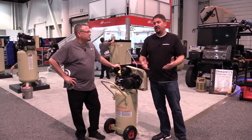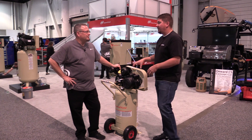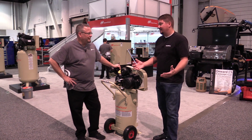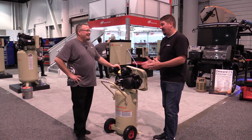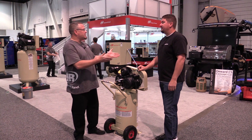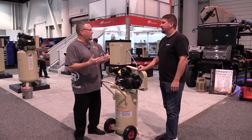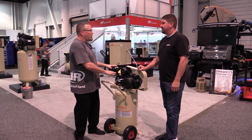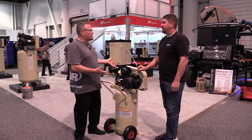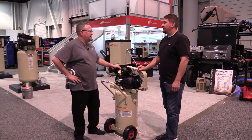Figure out exactly what you want to use. Commonly we see someone who buys an air compressor saying it will run their half-inch impact wrench, and then they want to get a big sandblaster — it doesn't work that way. You definitely want to make sure you apply the appropriate machine. Sandblasters use in some cases upwards of 60 CFM of flow. If you get a small machine rated for only 30 or 40 CFM, the compressor is not going to last long — it'll be working hard, won't keep up, and you can burn up the pump.